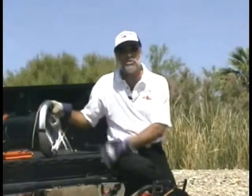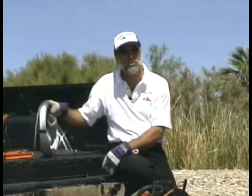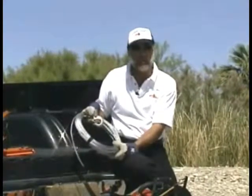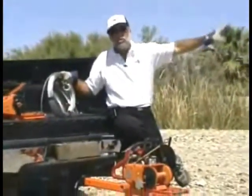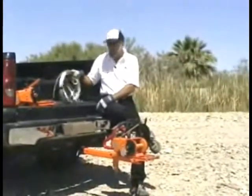The downside, of course, with steel cable is that it will kink, and you have to be careful, especially when you're first unwinding it. Now, when it comes in the box, it's all wound up like this, and of course it doesn't really want to go straight. So what you have to do is persuade it and stretch it all out, all 150 feet, in a long straight line, being very careful that you don't kink it. That's actually the most critical time for your cable.